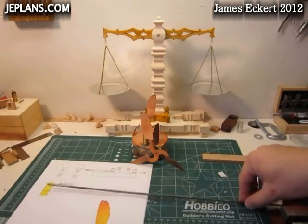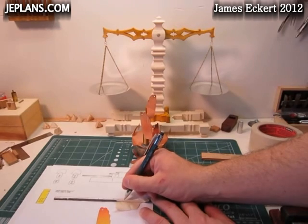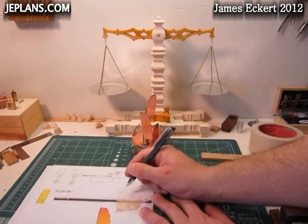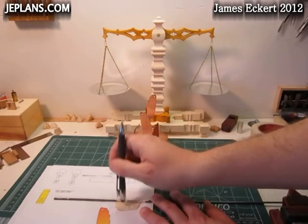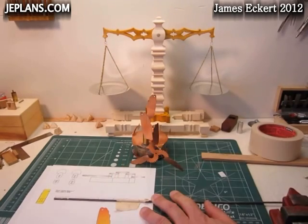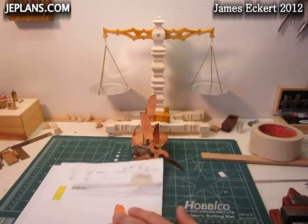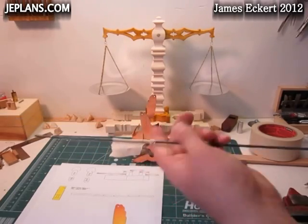We can't really easily mark music wire, so I'm just going to put a little piece of tape on it. Right here is where we want to cut actually. We'll make those other marks later once we've cleaned up the shaft a little bit. We're going to use a rotary tool and an emery disc to cut that off.